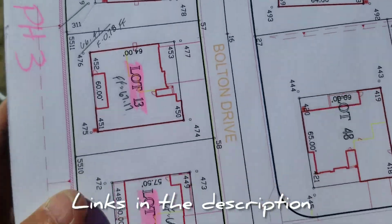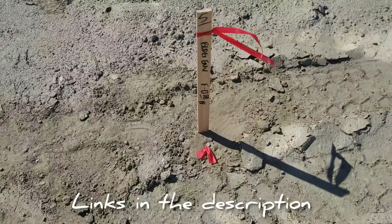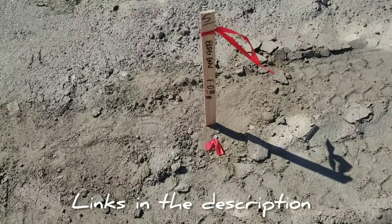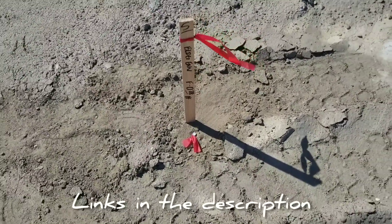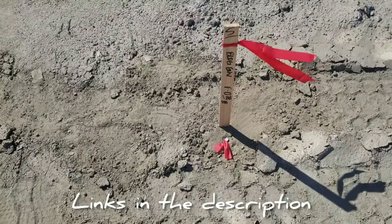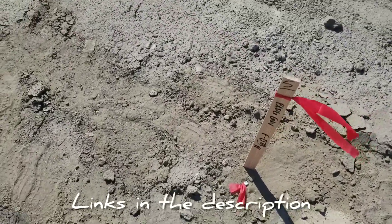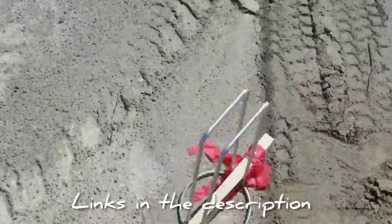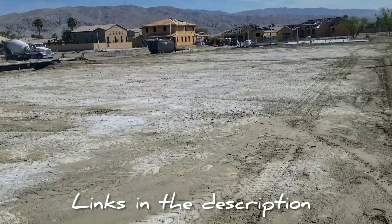On any stake you're going to have an offset, what it's offset to, and if there's an elevation you'll have a grade to something. This is all in regards to homes, buildings, and building envelopes — normally things are graded to the finished floor or the pad. Let me know if you have any questions.